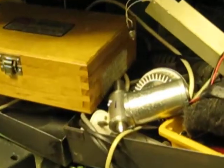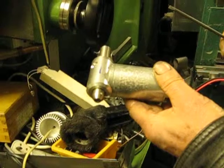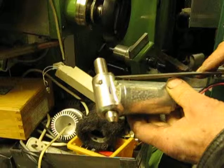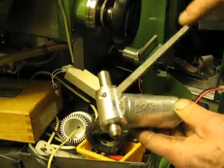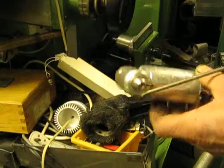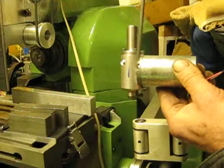There's something shiny down here — that's an impact engraving head. It's made from an electric motor with an eccentric and a ball race mounted on the shaft, so the ball race runs eccentrically. There's a slot in a rod which pushes and pulls that rod up and down. You put a pointed tool into the hole and clamp it in — that then sits into the main milling spindle. Power the motor up and it impact engraves anything underneath it.